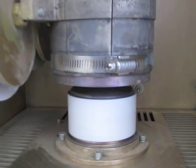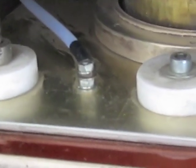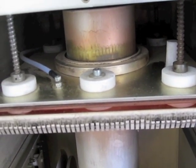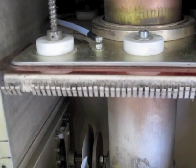There's not much clearance there, which is why I had to take the whole bottom of the tube assembly out. And there's that chimney. That wire there that attaches to that plate — that's the high voltage. That entire plate is at the high B+ voltage, about 6,000 volts in this transmitter. That's why there's so much Teflon around — Teflon parts insulating those threaded rods from everything else. There's also a piece of Kapton insulating the high voltage plate where the hot air exhausts. So the whole chimney is at high B+ voltage, the way this transmitter cavity is designed. There are different designs and some are like this and some are different.